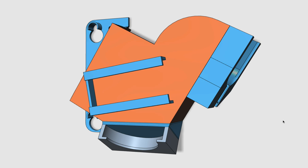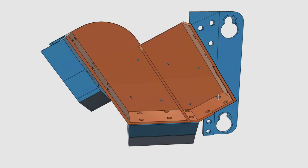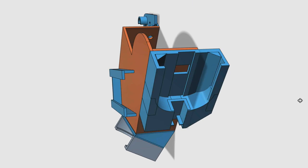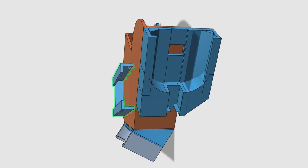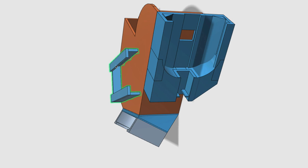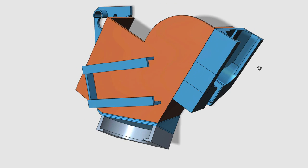Let's take a look at the Apple TV mount next. It attaches with pins as well, although I ran into some problems in production. Here are the pins on the other side — the walls here are only 2.5mm wide so I couldn't use the 5mm pins. I printed the Apple TV piece with this side flat so again we didn't have any overhangs to deal with in the printing. Let's watch the Apple TV bracket print.